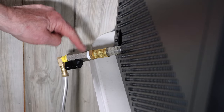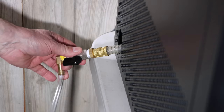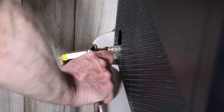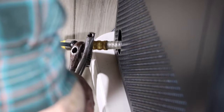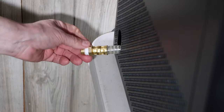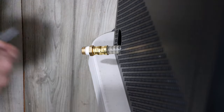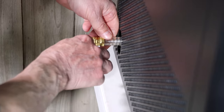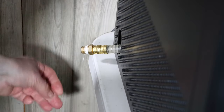To remove your drain valve, you've got to unscrew this part from that part, and you need wrenches to hold both pieces as you twist them off. You don't want to just try and twist with one hand because you're twisting your pipe. I'm going to use two crescent wrenches here. Once it's off, all the old Teflon tape has to come off. That can be a little aggravating — a wire brush can help, or a good pointy item. I like using my pocket knife, but use whatever you've got. You've got to get all that old Teflon tape off to get started.